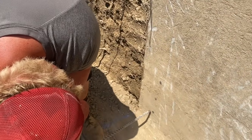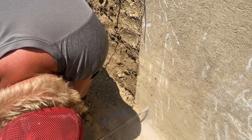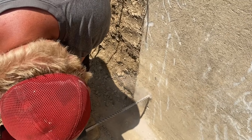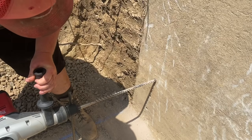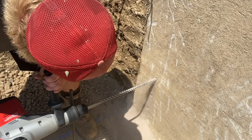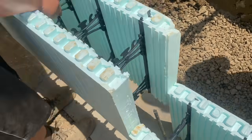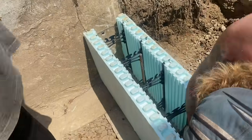Let's see if they core drilled this one, or core filled this one. Probably not. Tuna, stick those rods inside that wall. Both, just two of them. Push them in a little bit. Yep. And put your block in there. Okay, now take those rods, stick them in the wall as far as they'll go. Just the bottom two.